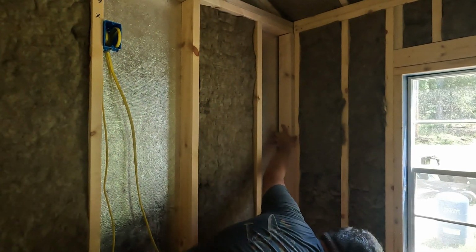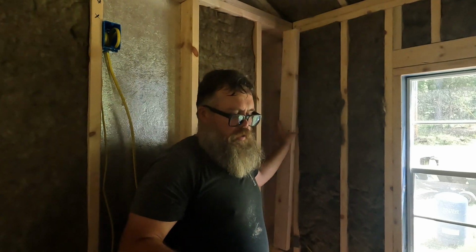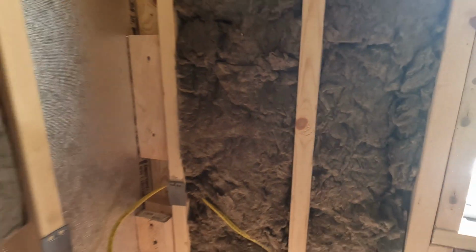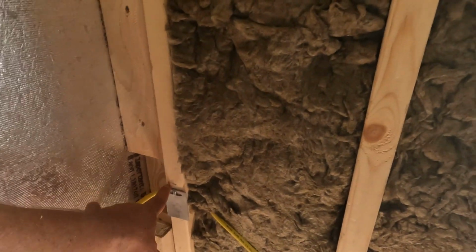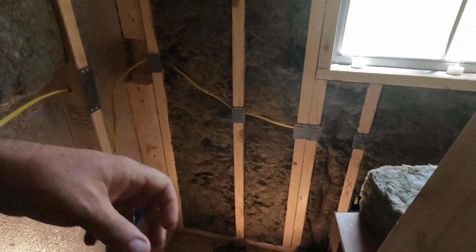I'm gonna have to take more off of that. Only because I don't know if you guys can see, but they put metal plates, little protection plates for the wire. So these here, basically, you can't put a screw or a nail or anything like that into the stud. It protects the wire, right? It's safe. It's good practice. Not everybody does that. I'm glad that they did, but I can't put the other stud here because it hits this plate. So I'm gonna go shorten it down some.